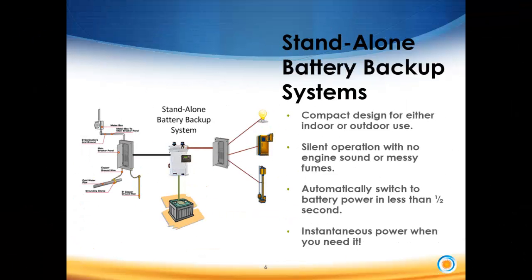Well, this new picture shows a Flexera designed battery backup system. Let's discuss how it works. We actually create a second mini AC grid in your home by adding an emergency load service panel. Through an interview process with the homeowner, Flexera moves critical loads like refrigerators, some lighting, and pumps onto the new critical load network. All loads that are not critical remain on the original service panel.